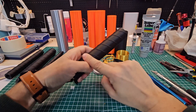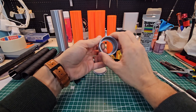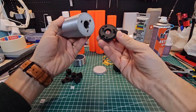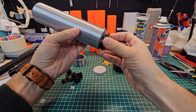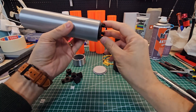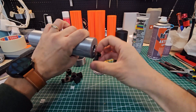For this assembly it would be good to have some kind of lubrication, especially for these parts — I'll put a thin layer of oil on them, and inside the gearbox I'll put a little bit of grease to make sure it runs smoothly. There will be one part that is going to be glued, and that is this part, which should be glued at the bottom of the housing. There is one round hole and the rest are squared, so it fits perfectly and doesn't need much glue — it won't twist because of those tabs.